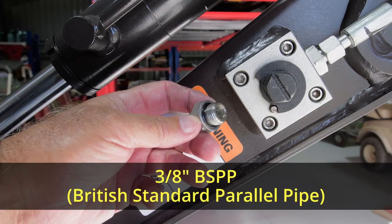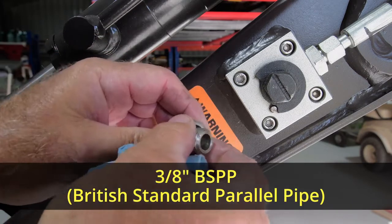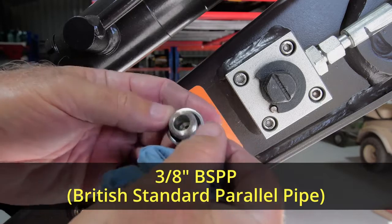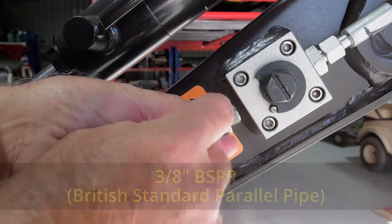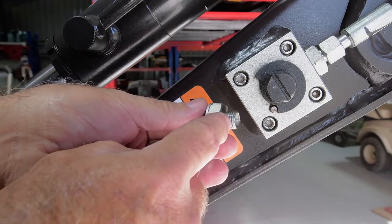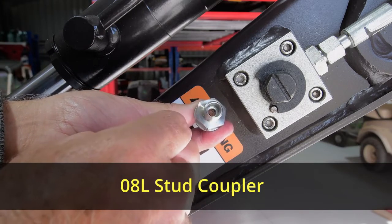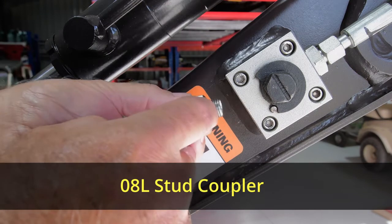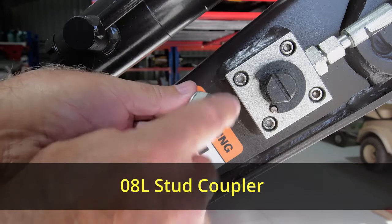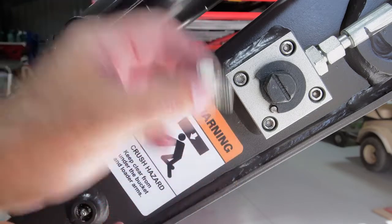This thread is called a 3/8 inch BSPP — British Standard Parallel Pipe thread. Because it's a parallel thread, the seal is actually from this o-ring that sits here, and then a metal ring sits on the outside, and that gives you just enough when it's sealed up that the o-ring stops any oil leaks. On the other side it's a smaller connector called a metric light connector, measured on the inside diameter of the opening — which is 8 millimeters — so this side is called an 8 metric light connector. That's what's currently on all the pipes and hoses that go to our attachments. I'm not going to throw this away because I'm going to use it in a minute.